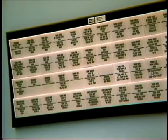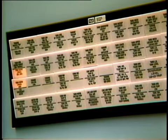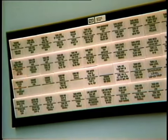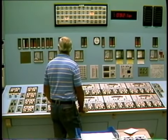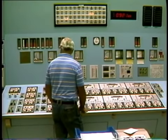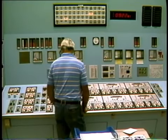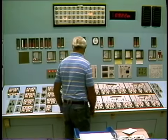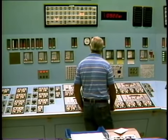It is essential that all protective devices on the boiler, including trips and alarms, be functionally tested at regular intervals to ensure that they do operate as required. You must be aware of the function of all protective devices and alarms on your particular boiler. Make sure that you know where all of the respective sensors are located, and also try to take part in the testing activities for protective systems.